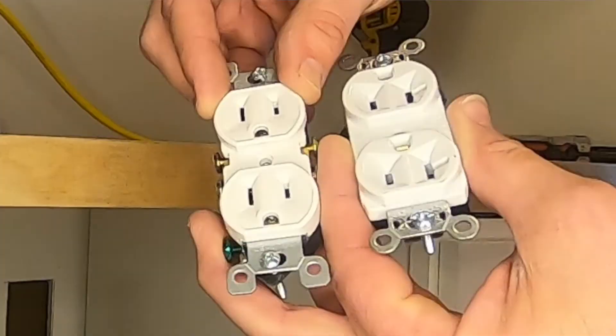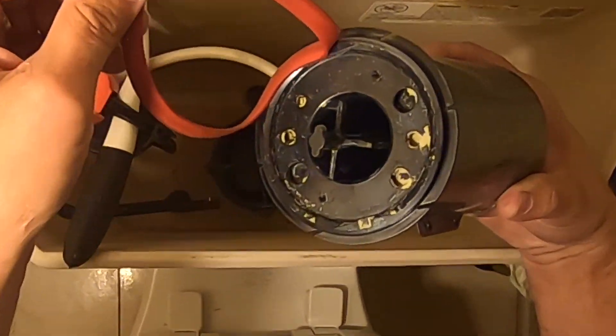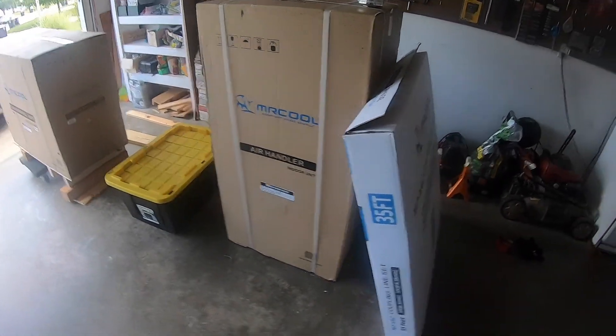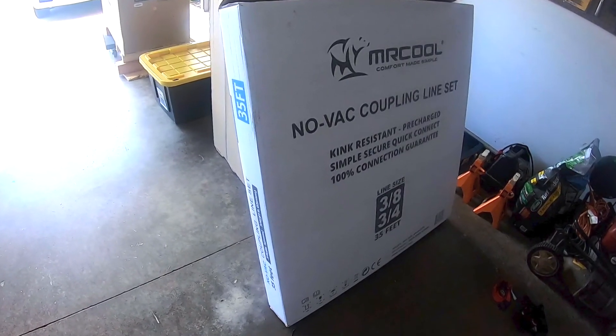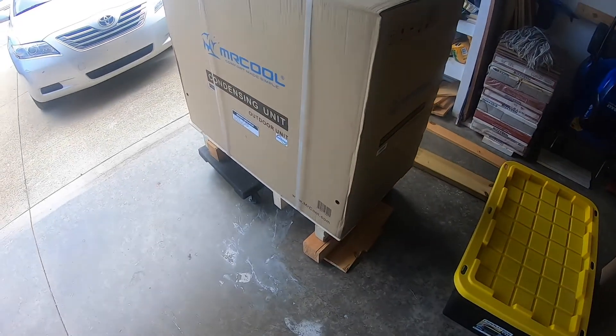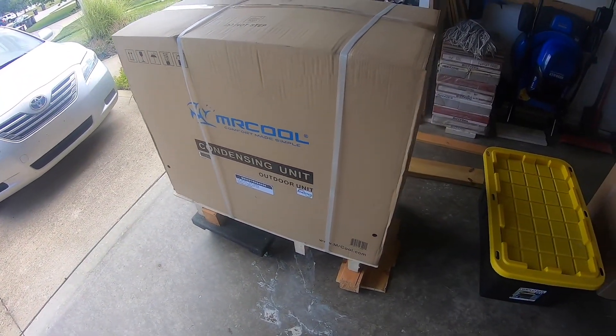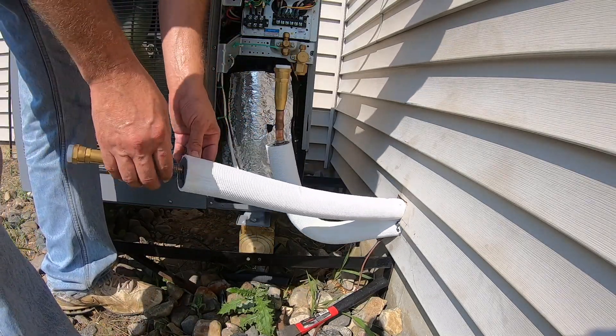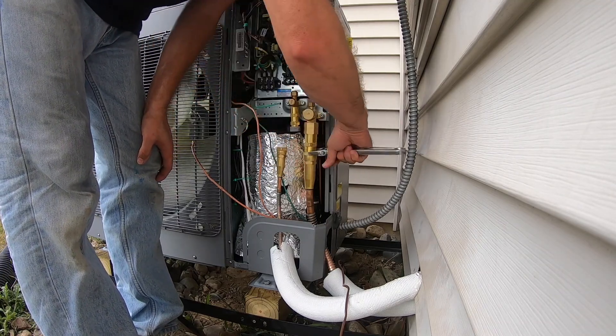If you've seen any of our channel you know we do a lot of things DIY and try to show you how to save money in that process. We ended up saving thousands and thousands of dollars when you compare the two systems — a brand new Trane versus a brand new Mr. Cool heat pump. We had additional savings in that we didn't have to hire an HVAC company to set it up. What made it so doable is that they have pre-charged line sets, which means you don't need any special tools to connect the condenser to the A-coil. We found a line set length that fit our situation and I was able to put this all in on my own.